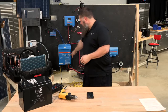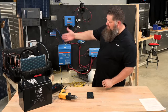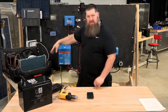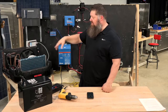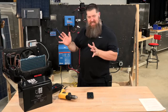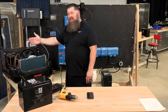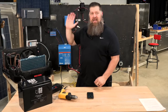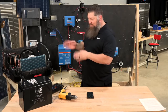I'm currently set up, and the lithium battery is running on the inverter — we're not plugged into shore power, just one battery. I'm going to turn on the fan first and then the compressor. The fan typically pulls about two and a half to three amps, which will show up as about 20 amps from the battery — again, 12 volts to 120 volts. Let me explain how easy starts work: they work in conjunction with the capacitor. When you turn on the air conditioner at the thermostat and the thermostat calls for the AC, the fan turns on first, then typically about five seconds later the compressor turns on. With a soft start installed, we extend that to about 10 seconds, and it slowly sends out the amperage to the compressor so you don't get that huge inrush — it allows the system to run a lot quieter.